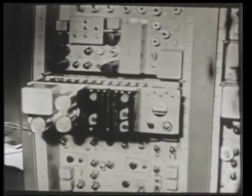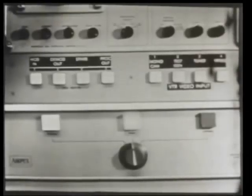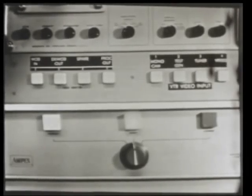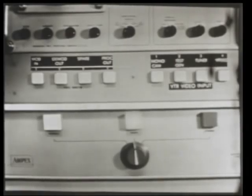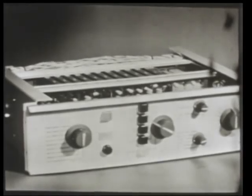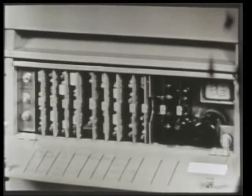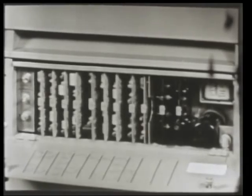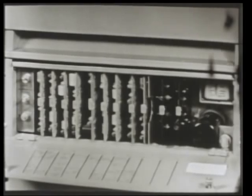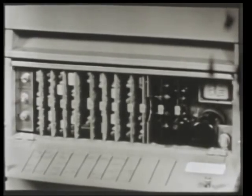This superior capability in time-based stability circuits also made it possible for Ampex to develop the first system for electronically editing tape with the electronic editor, and as a result, Ampex was able to go on and produce Editec in 1963, allowing automatic frame-by-frame animation directly on tape. The servo system in the VR1100 is the latest version of the basic Amtec system on which all of these technical and operating advantages are based. Once again, it's the best you can get.